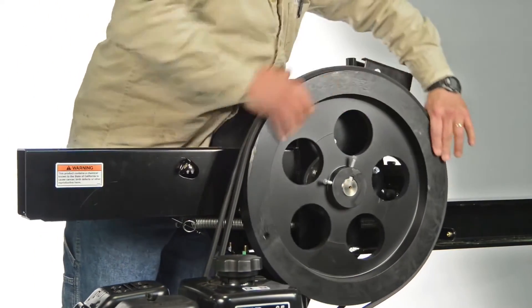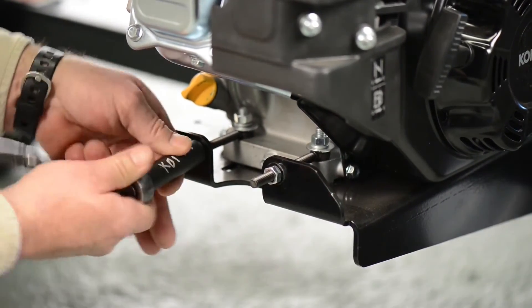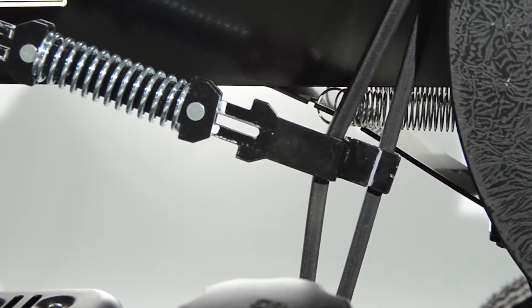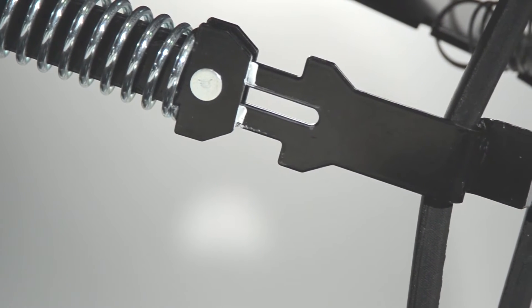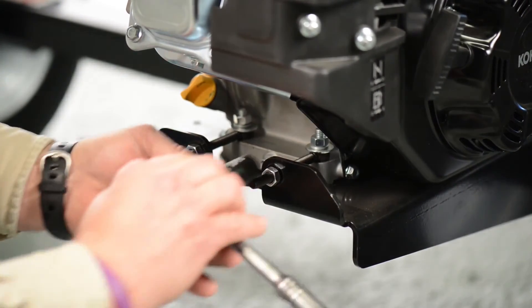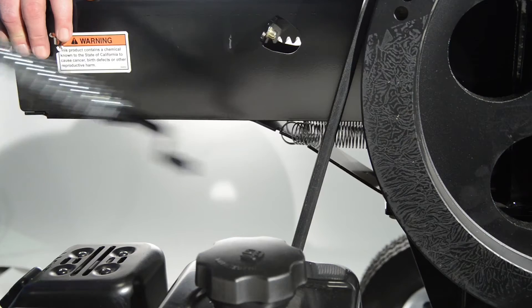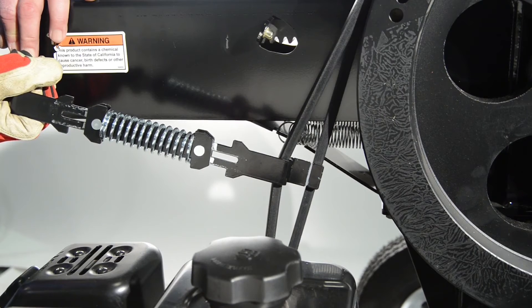Now that the belts are secured, the next step is to set the belt tension to 60 pounds. Be sure that the engine stays square and aligned with the flywheel while you're adjusting the tension. Take the belt gauge that came in the crate. Use the hook to grab the belt at the midway point between the flywheel and the clutch pulley. With one steady motion, slowly pull the belt until the hook side notches align with the top surface of the belt you're not tightening. After aligning the hook side, check the top area of the gauge. When the notches on the side handle align with the edge, the belt is at the proper tension. If the notches are not aligned, move the engine forward or backward to reduce or add tension respectively. Now you can tighten the engine bolts. Secure the top nut while tightening the bolt head. Recheck the belt to ensure it's still at the proper tension. Note that over-tightening the belts will cause premature wear and failure of the clutch assembly and may cause wear on the engine shaft.